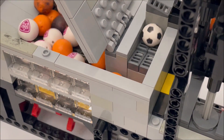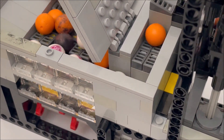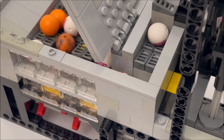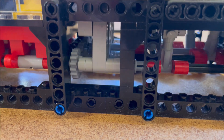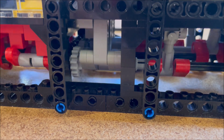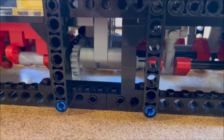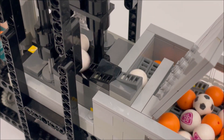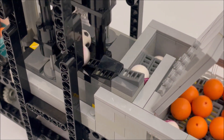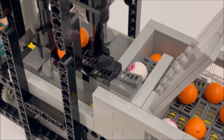The biggest layout change comes from the reorientation of the middle steps. These used to all ride on one of the crankshafts, but now each step rides on a different shaft. As a result, the module lost the weird cutout that previously housed the motor and the not particularly necessary counterweight. I relocated the former and removed the latter, and I think this arrangement feels more elegant and looks better.